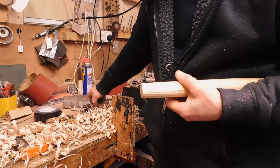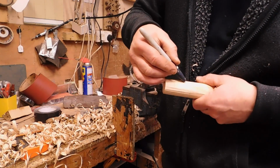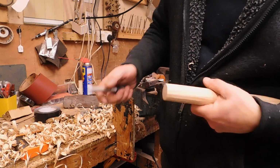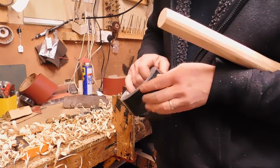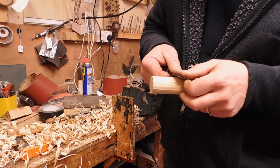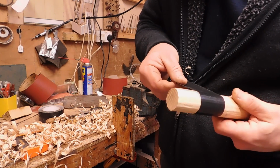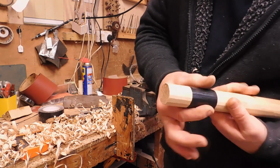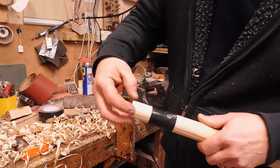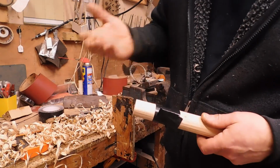If you haven't got one of those, and you're trying to do it with a pen, you inevitably will wobble and your 2 lines won't line up. So a really good tip is you get just a bit of tape and you stick it down, and you can just guide it around, and you see now I've got a perfect line here, and I use that tape as a cut line. That's another way of doing it.